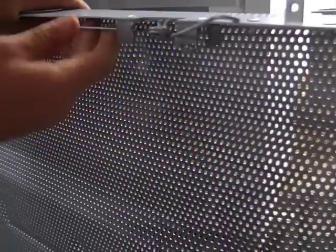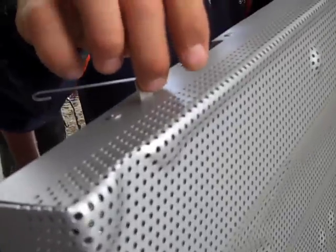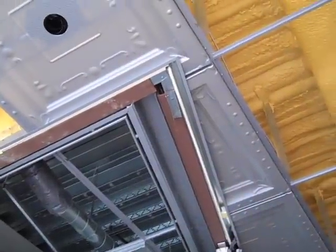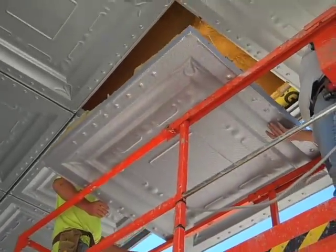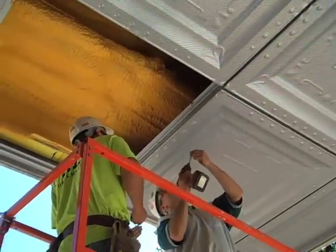A worker explains the panel system: "They'll have a spring on them... and then it just pops up in there, kind of like a can light when you put a cover up in. Spring, and then the exterior — I'll have a clip here after the panel's installed, and just screw up into the ceiling grid. So she don't fall down." The panels are fastened into the grid and cut around the complex geometry of the first-floor glazing support walls that drop down from the structure above. Here we see workers lifting a panel into place, attaching the spring-loaded wire, pushing the panel into place, held there by the spring-loaded clip, and then screwing the panel into the grid through the tabs that extend into the panel joints.